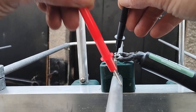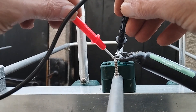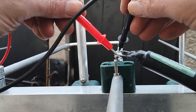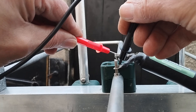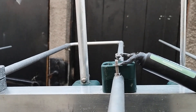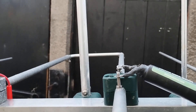Much better — so that's okay on that one. I'll just dual-check this balun. That's fine — no short circuit there. That'll connect onto that terminal, and I'll go onto that terminal. There's a screw — got much better results than what I had a few moments ago. So that's probably what the problem was.